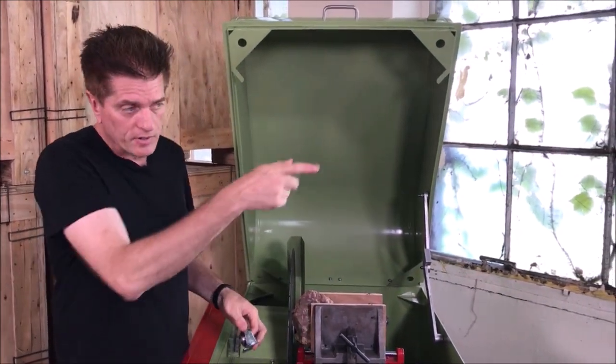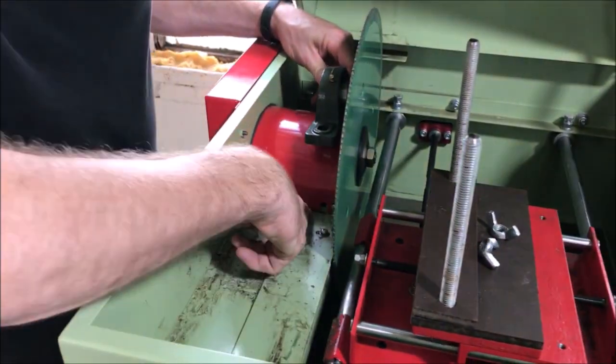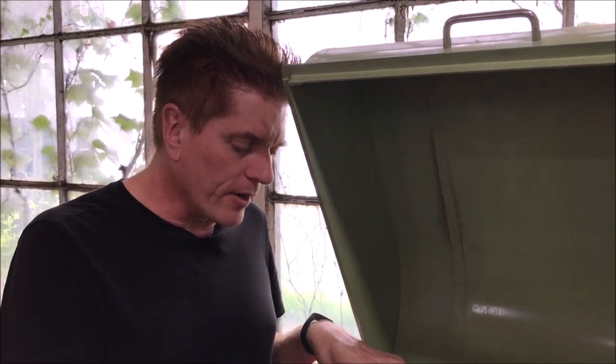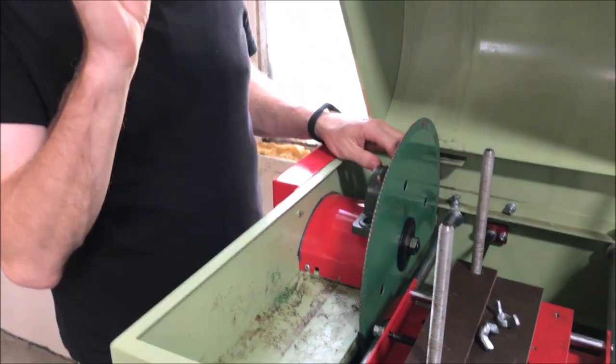When we did the high tone series, that saw over there, fortunately I can't show you in the moment, but I can show you a little bit, that underneath this bearing cover are two bearings, and you'll see there's a set screw there and there's a set screw there. These set screws, both on the front and the back, hold the bearing in place, and the bearings here thread into a half inch thick plate of steel. So you don't have to reach underneath and put a lock washer and a flat washer. Literally, you can just tighten right down into the arbor plate, and these set screws allow you to precisely align the saw. So your saw, when it comes from Highland Park, is perfectly aligned, so you can immediately start cutting with it and produce great results.